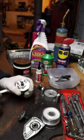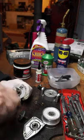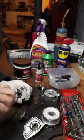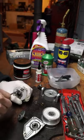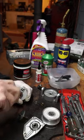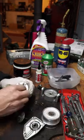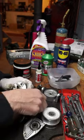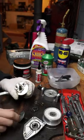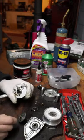And then I'm down to the ball bearing. The ball bearing is held together by two Phillips head screws. Again, keeping the pieces and parts together on these for orientation. I also found that if you're not that comfortable doing this, or if you don't do it that frequently, use the camera on your smartphone to take pictures at the various stages. What that'll enable you to do is to know where the parts go if you've lost the orientation on those.